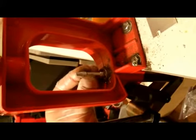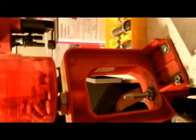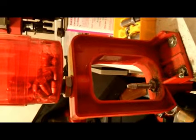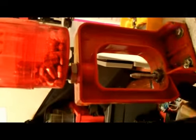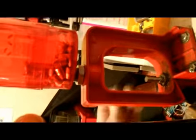So we put the bullet on the little shaft here, and it goes up into this die that has an orifice that sizes the bullet to the correct diameter. Otherwise it won't load into the gun properly. It'll get stuck and you'll have misfeeds. So push it up and it just goes up in there. And the bullets collect on this little canister on top.